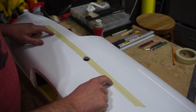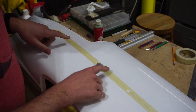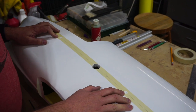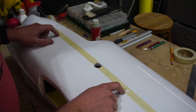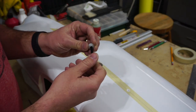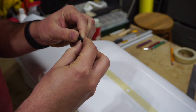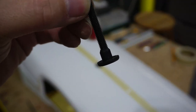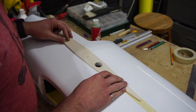I've taped up this side and drawn a centerline through both recesses for the anti-rotation or hold-down bolts. You don't necessarily need wing adjusters if the wing incidence works for you — you could just use these hold-down bolts as your centerline. I'll probably put the adjuster in to make field setup easier. I'm going to remove both bolts now. They're metric 6, include a thumb screw and nut, and have a slightly larger diameter at the base than at the threads.